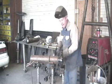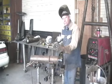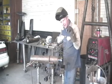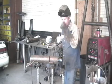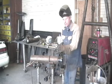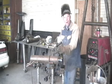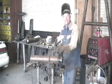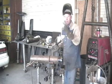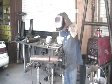I'll show you the inside of that weld that we made on that 90. I don't know if you remember, but there was a big keyhole that I had to stop and kind of just butter it in there, and the metal sagged really too much inside the bevel. That type of glob hanging inside your weld could be too much. It's called excessive penetration, and on a critical weld path, that wouldn't make it. I'd have to cut that out and then try again, and then I'd be struggling the rest of the time welding it.